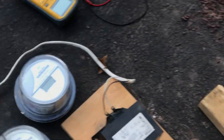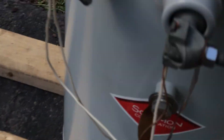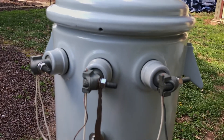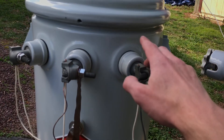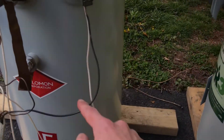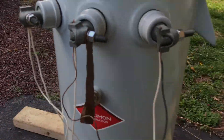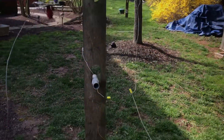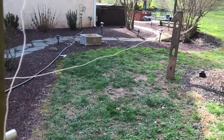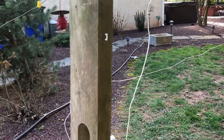And this is how they're wired up — just an extension cord, no ballasts, to this 240 volt step-up transformer. And then each one of these: L1, L2, and L3. So I've tied them respectively together so that they are peaking at the same time instead of reverse times — so they're in phase.